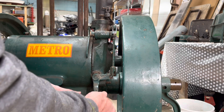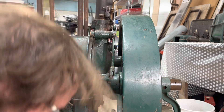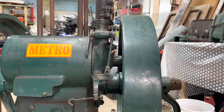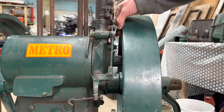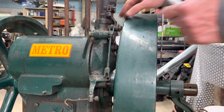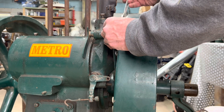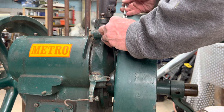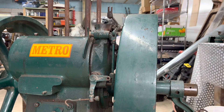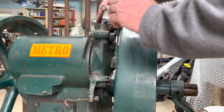The next thing is to get rid of all of the governor linkages — this will just come off. There's the spring. This is a really tight fit right here — this bolt has the pivot for the rack on the injector pump, and you wouldn't think it would come out, except it does. So you loosen this up, take that off. You end up with about zero clearance against the flywheel and you say to yourself 'it won't come off,' but then it comes off.